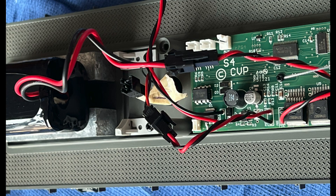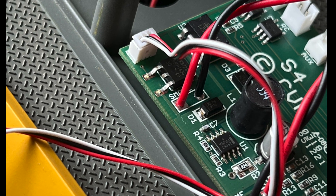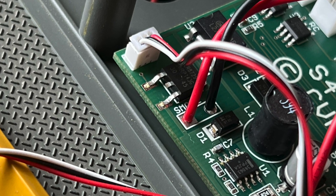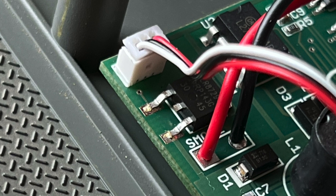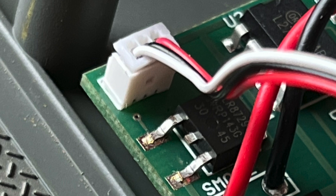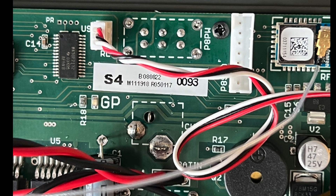You can see the battery on the left; it is plugged into the battery-in port on the decoder. The front light connector has three wires: one ground, one for the headlight, and one for the number boards. The headlight should only be on in forward, and the number boards should always be on. When I first connected this, the number boards would turn on in forward and off in reverse, and the headlight was always on — so I had to flip that connector around backwards.